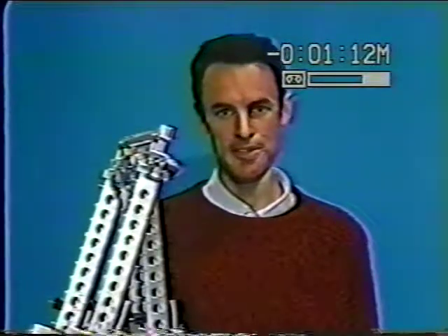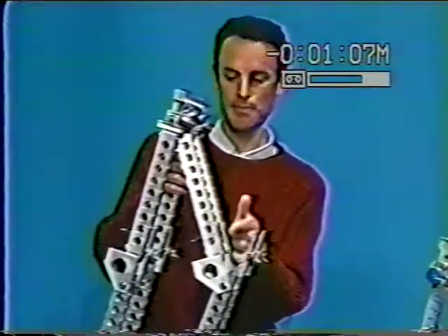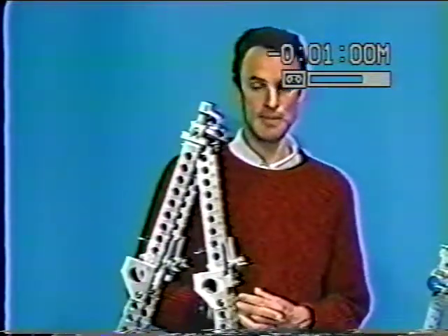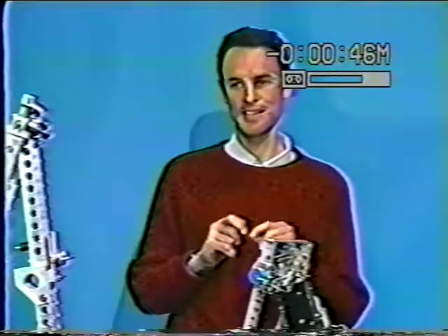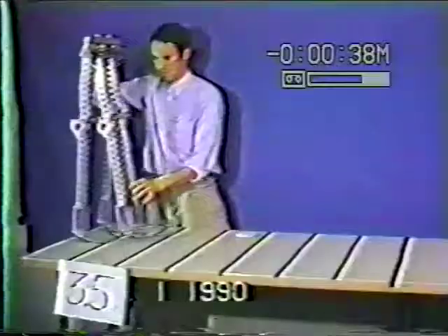After a few days, we went to a different system. The present machine uses a suction cup and a carefully sized lead for the debouncing — that's what you'll see working on the next few clips. What we'll show is a variation in walking speed with slope. With the straight-legged machine, we started at one percent and went up to three percent. In the clips coming up, the machine starts on a three and a half percent slope, and the range for good walking is from four to six percent.